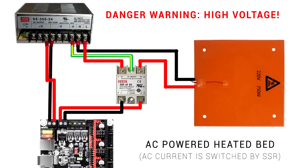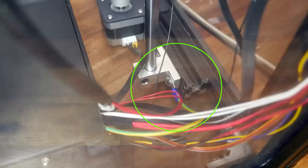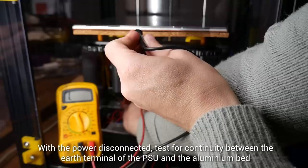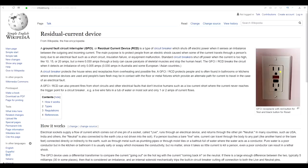Now let's revisit that earth green and yellow wire on my diagram. Because I'm running a plastic 3D printed case, it's important to earth the solid state relay as well as the printer frame. I made up a custom loom that goes from the earth terminal of the power supply to both my solid state relays, and then a final terminal to go to the frame. It's important to either scratch away the anodised surface or pick a bolt that goes inside the aluminium frame — I chose one down the bottom of the Z guide rails. With the printer turned off and the multimeter set to continuity, touch the earth terminal on the power supply and the aluminium heated bed to make sure they are connected. On an Ender 5 this is straightforward as the bed only travels up and down, but on a printer where the Y axis moves the bed, please see my previous guide on how to earth that safely.